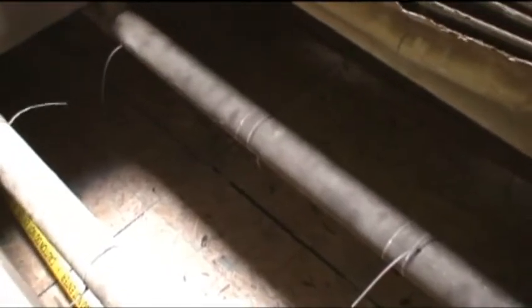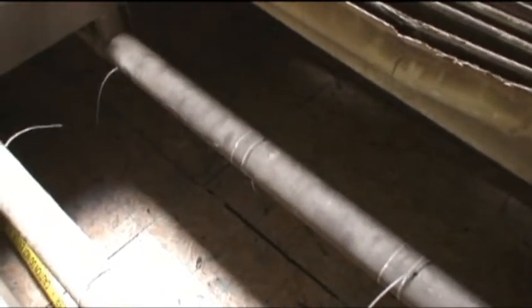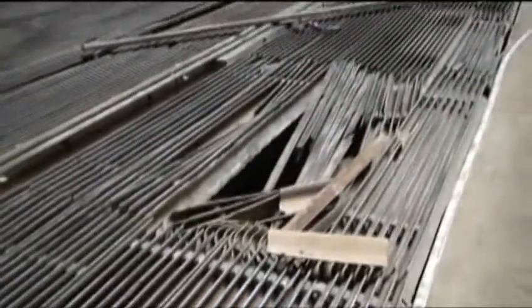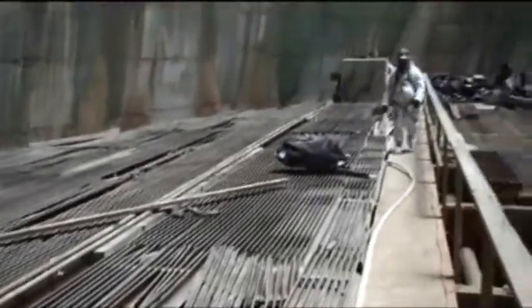Underneath is where we rigged it and installed all the OSB plywood in order to protect the separation pieces. You can see some of them located right there. We put 2x4s on each side, protect those, and then cover them so that they don't get damaged. But once again, you can see a lot of damage to the drift eliminators up here over time.